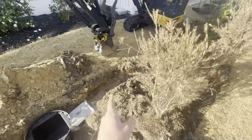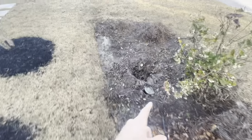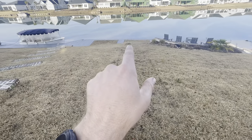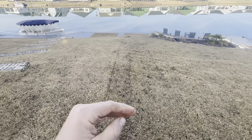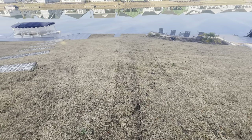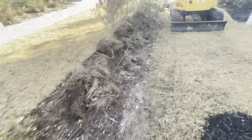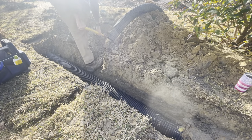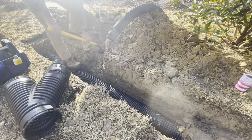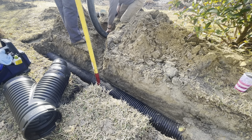We're going to take this system back probably another 80 feet or so through here. We've got another pop-up to tie in, and I've already got the sod pre-cut. We're going to come to a 6-inch pop-up that'll perk and flow into the lake eventually — it needs to be 15 feet off the lake. That's DHEC requirements so everything can be filtered out into the grass and soil first, in case they get their roof cleaned and they're being irresponsible — they don't want chemicals right into the lake. We'll start by getting the old pop-up removed, then tie in another piece of 4-inch corrugated with an internal coupler and ceramic tile tape. Make sure you go heavy on the tape — you'll regret it later when you have roots growing into your system.